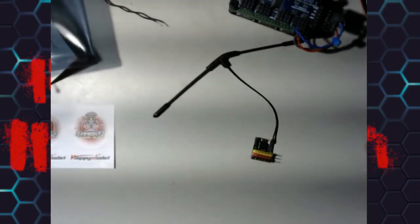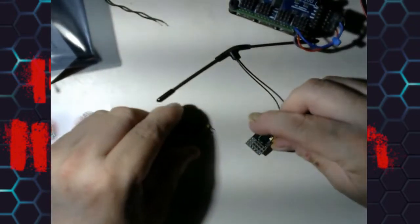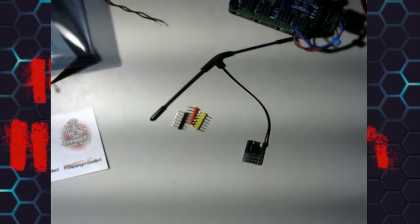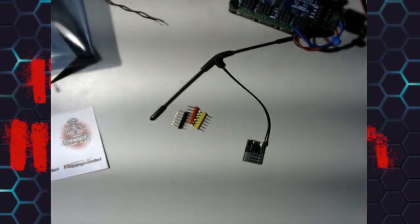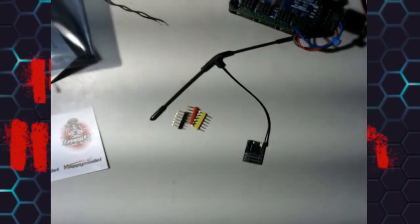Now, people have had some problem with these being in constant boot mode, which suggests to me that there is a possibility of either a physical fault in the board or a fault in the software. I won't totally rule out a fault in the software, because the last one I got, even though it was ExpressLRS 2.0, would not go into Wi-Fi mode. Well, I would say it was in Wi-Fi mode, but the Wi-Fi hotspot that it puts out for firmware upgrades would not show up on any of my devices, and I couldn't connect to it till I flashed it over the UART. Then it showed up. It's fine. All is good.